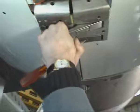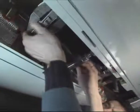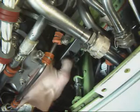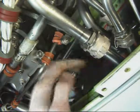Once the tension is relieved, release the 5 latches at all positions: aft, center, and forward. Now, the adjustment nut of the take-up device is loosened to disengage the take-up device, which is then stored on its storage bracket.